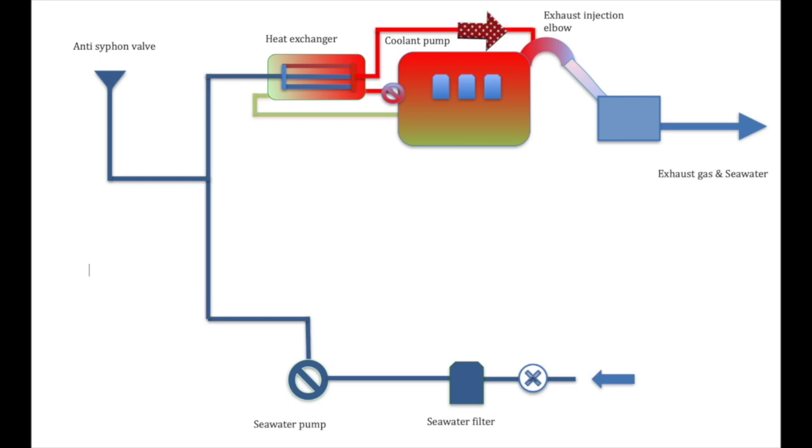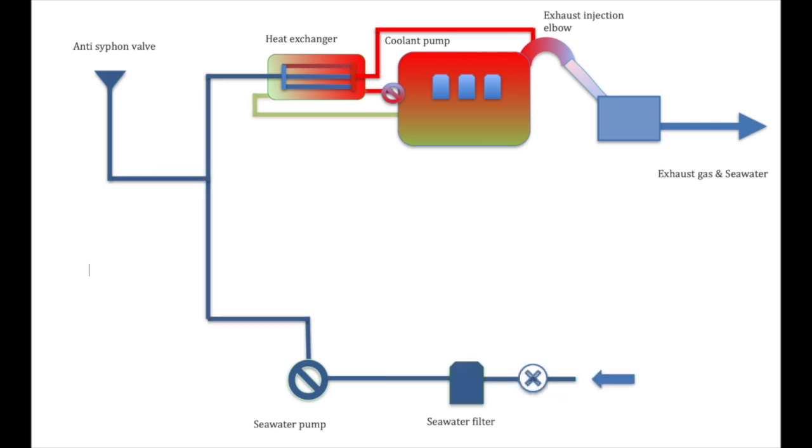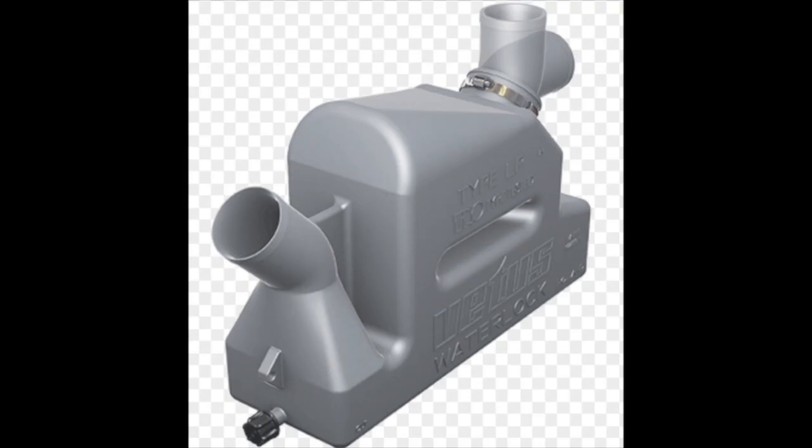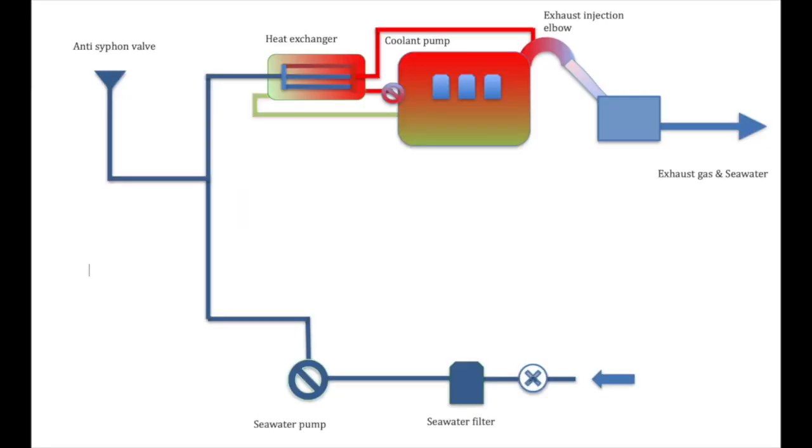The now hot seawater is pushed into the exhaust elbow. We've done a couple of other videos where we covered the problems around exhaust elbows and the water injection. I'll put a link in the description. The hot seawater and the exhaust gases will be pushed down the pipe into something like this, a muffler or water lock. Some boats have a separator which separates the exhaust gas from the raw water. This allows them to run a dry exhaust from this point forward.